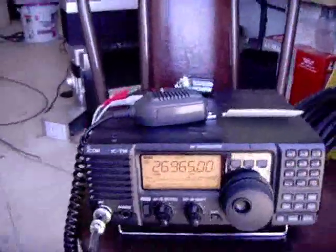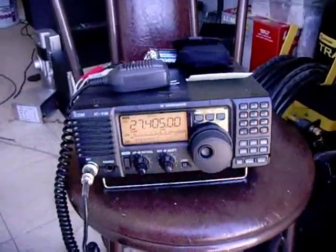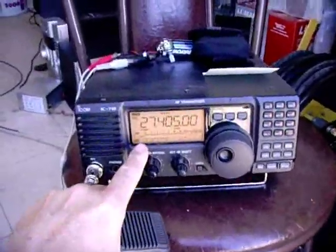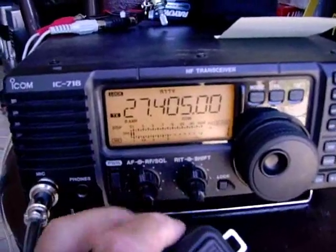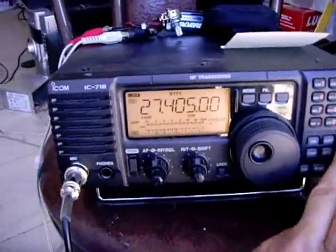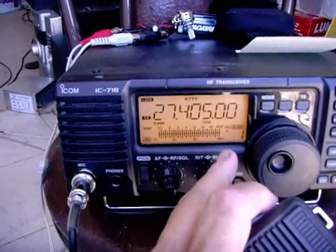Now we follow into the shop. We've got a radio and we'll look at the SWR on it. I'm using an ICOM IC-718 at 27.405 MHz, which is channel 40. Looking at the SWR setting — it's a little out of focus but that is the SWR reading. When I key the mic, you can see it's 1.1 to 1. And if I look at power output, you'll see it's full 100% power — producing 100 watts output.